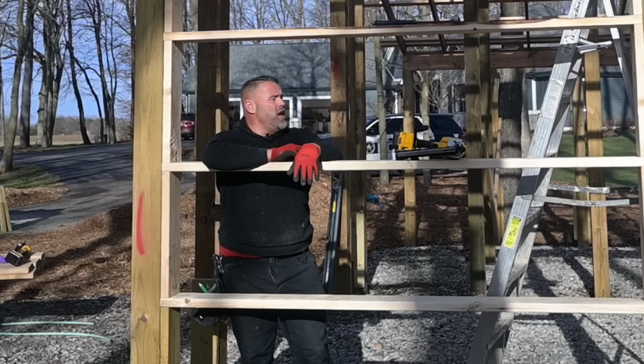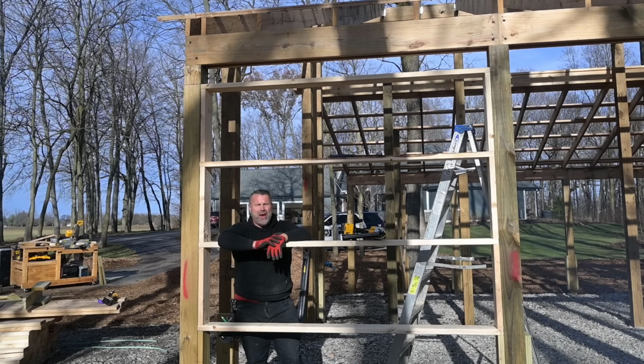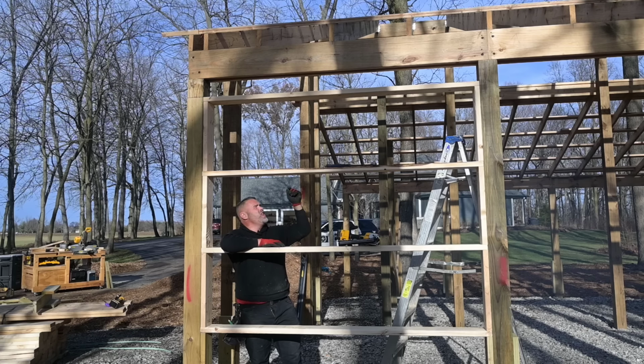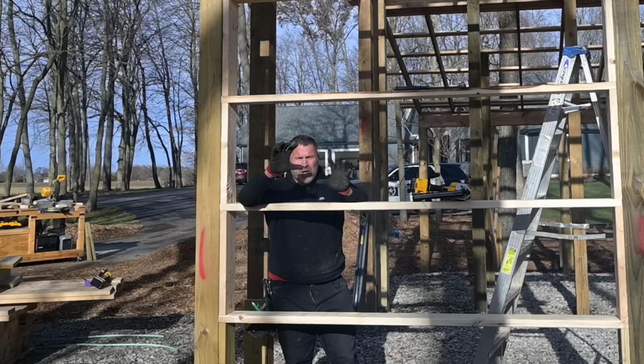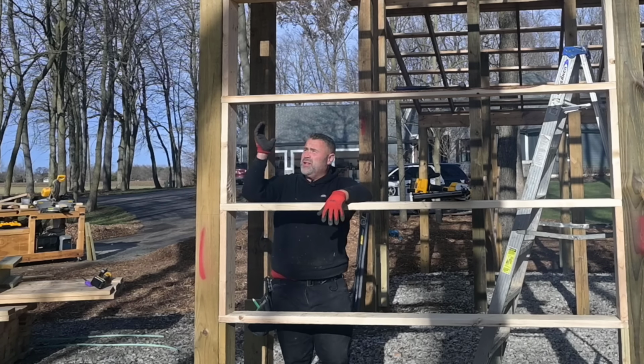One section done. We got what, 1, 2, 3, 4 bays of 22.5, which will fit 23-inch insulation, and we'll have to put a little sliver up there. Not a big deal. That's it. This is commercial bookshelf framing. Obviously it's bookshelf for a reason, right? I can put books here, right?